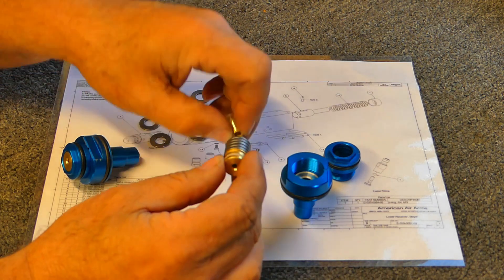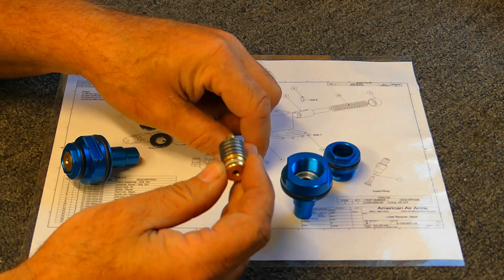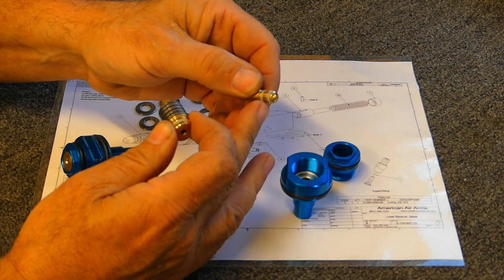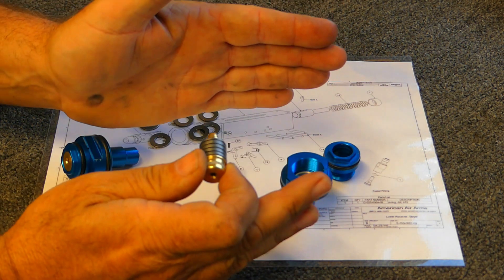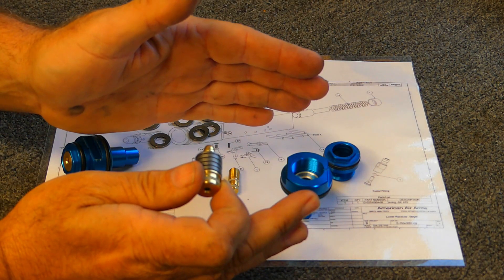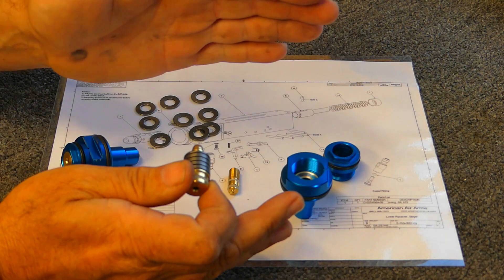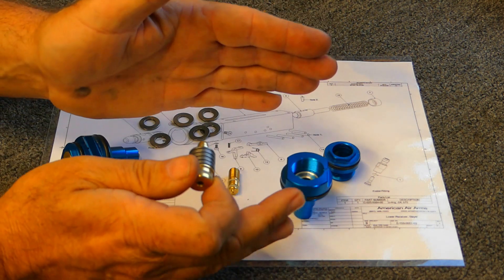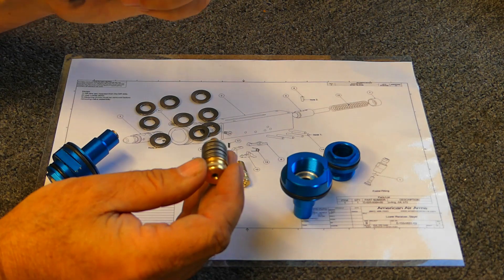The second place a regulator will creep is if one of your adjuster O-rings is slightly leaking, causing air to bypass. By venting both sides of these O-rings to the atmosphere, it eliminates the ability for there to be equal pressure on an O-ring. When an O-ring has equal pressure on both sides, it won't seal — it sits neutral in equilibrium, and that slight difference between neutral and differential will always bypass some air. That's why every O-ring on this regulator is vented to the atmosphere.